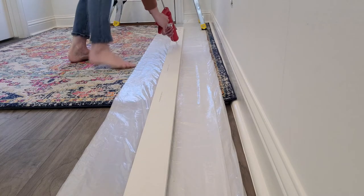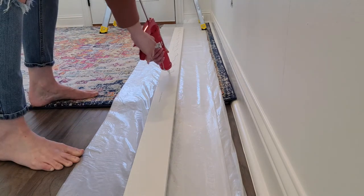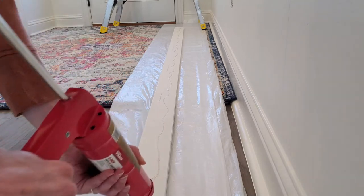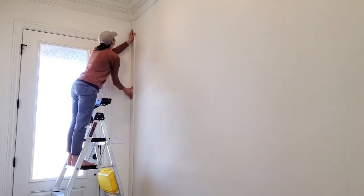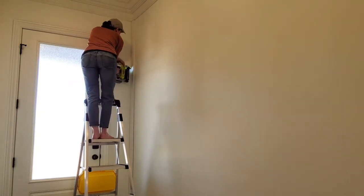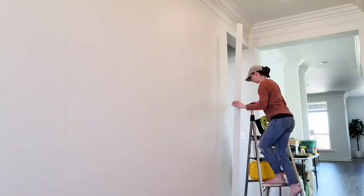To install the first board, I measured, marked, and made my cuts, then made sure it fit first. I laid a bead of liquid nails because I can't rely on nailing into the studs. You want to carefully place the board right against the wall — if your walls aren't even, use caulk to fill any seams. It was difficult doing it all by myself, but I used my ladder to hold it in place. Once the liquid nails had it set, I used an 18-gauge brad nail gun to secure it even better.